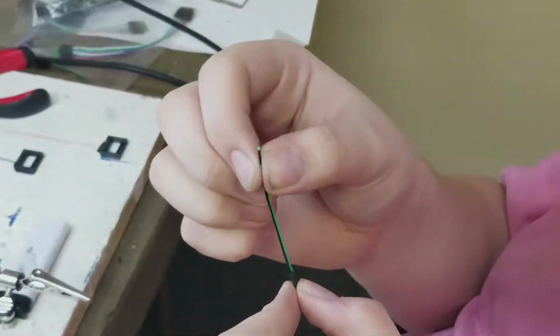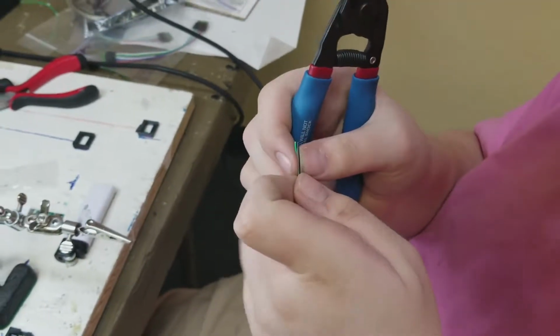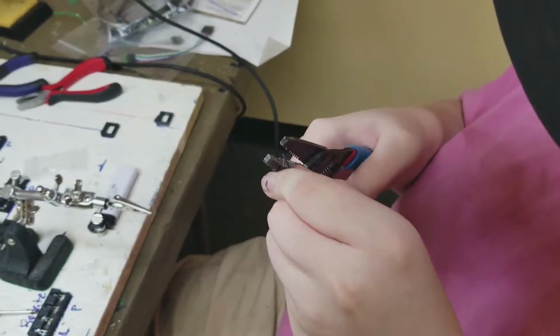Grab your first pair of wires and slip the wires through the correct hole through the front side of the board. Fold the wires outward on the board to allow for a clean solder. Do the same for all phototransistors and LEDs.